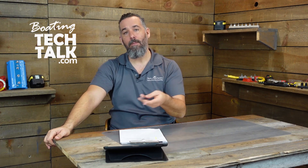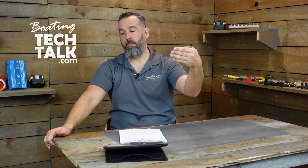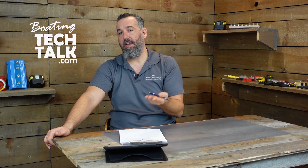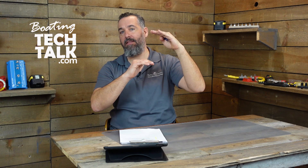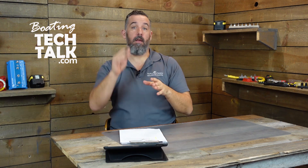If you only bring your batteries down to 70%, you have a very short window of bulk charging with an alternator, and that might be another problem, Mick — you're not letting your batteries drain low enough. It's okay to bring a flooded lead-acid battery down to 50%. If you do, you'll have 30% of capacity — from 50 to 80% — available to recharge under bulk. Once you reach 80%, it's just going to slow down.